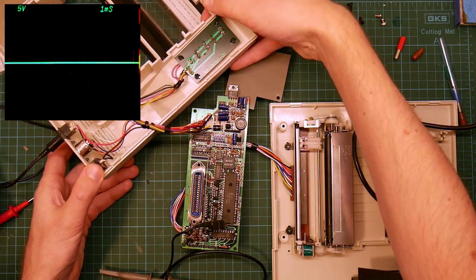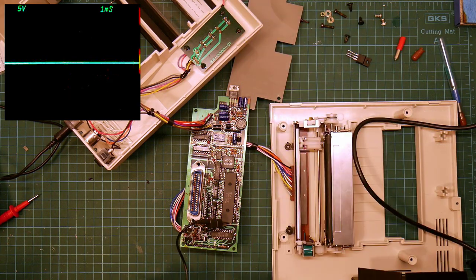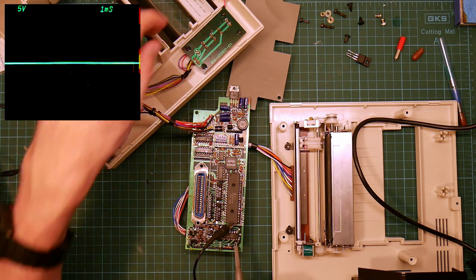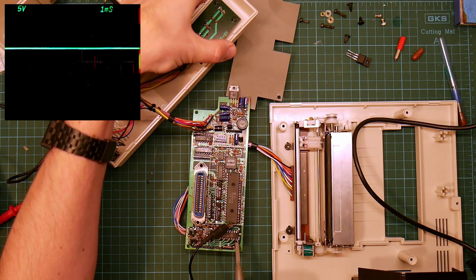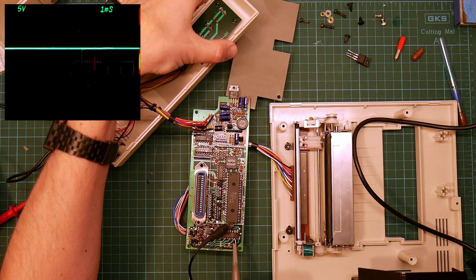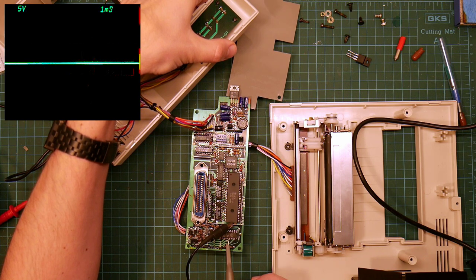So, I should be able to press this button. It should be driving this stepper motor, but I can see it going around a little — just not enough to actually do anything. Now what I want to do is touch these contacts and see what comes out. It does seem to be glitching when I press the button. The reason why I see it glitching is that the head moves sideways slightly. What that's supposed to be doing is moving the pen onto a little metal shield so that when the paper moves, the pen doesn't accidentally touch the paper and draw.